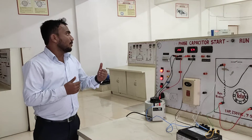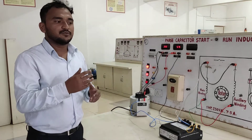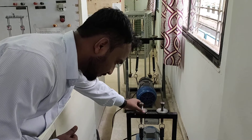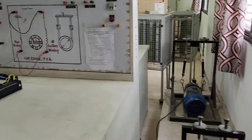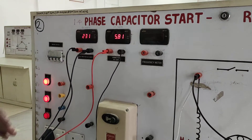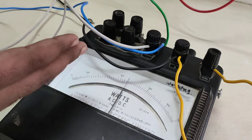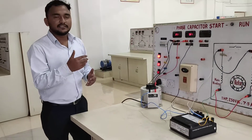Its multiplying factor is 2, meaning its actual power is near about 600 watt. To plot the graph between torque vs speed or output power vs torque and get a smooth waveform, we take 2 to 3 readings. We increase the load W1 and W2 again: current is now 5.8 ampere and power is near about 340 watt, so actual power is 340 × 2 = 680 watt — a huge increase by increasing the load.